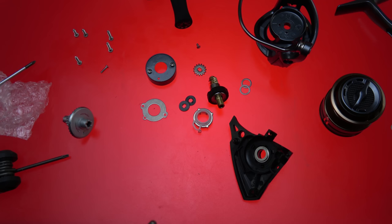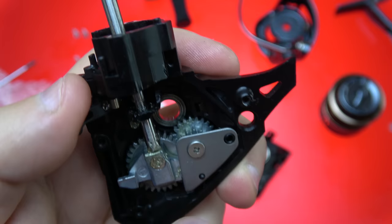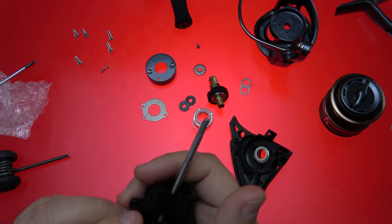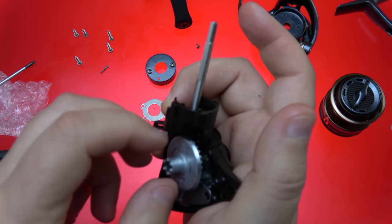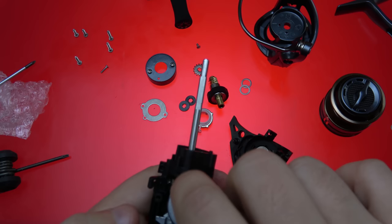And you can see how they do this slow oscillation. They have a reduction gear here. So if you see this, that runs off the drive gear. That turns the larger wheel. So it kind of reduces its ratio. So it slows down. See how the shaft goes up and down fairly slow? Or it did. Goes up and then it goes down.